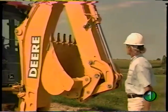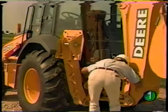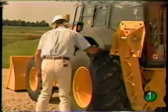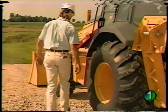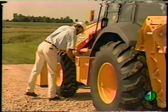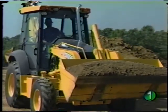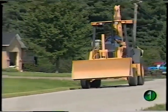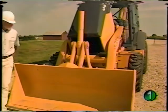When doing your daily checks, look around the machine for electrical, mechanical, or structural damage, missing bolts, excessive wear, or anything that might cause a failure at a critical moment. This inspection should include the ROPS and its fasteners. Also check for loose or missing wheel hardware. Check all four tires on both sides for cuts or problems that may pose potential downtime, and make sure the tires are properly inflated. Low pressure can make the unit less stable when carrying a load, while too much pressure makes the unit harder to handle on hard surfaces. As you walk around the machine, check for trash in the radiator screen that could cause overheating of the engine or other components.